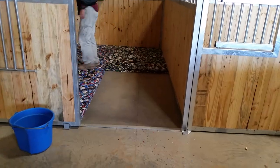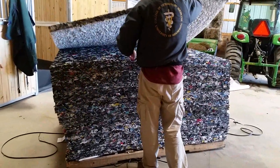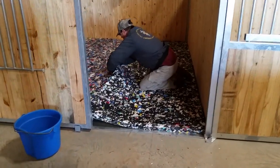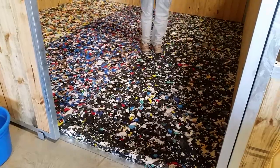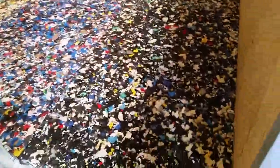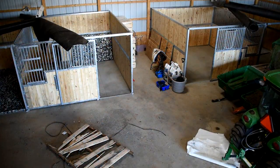You could go with the chunked rubber. The chunked rubber works well for big drafts and big horses. But what I don't like is that you can't get it completely level. After about three or four months, your top mat gets a little sag and stretch because of where it isn't perfectly level, and that's where urine tends to sit. But this stuff goes down absolutely completely flat if you've done your prep work — if you take your sand, gravel, or concrete base and compact it, level it, beat it into the ground, and lay this high-density foam on top.